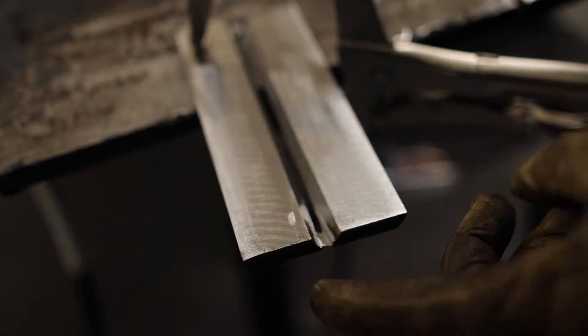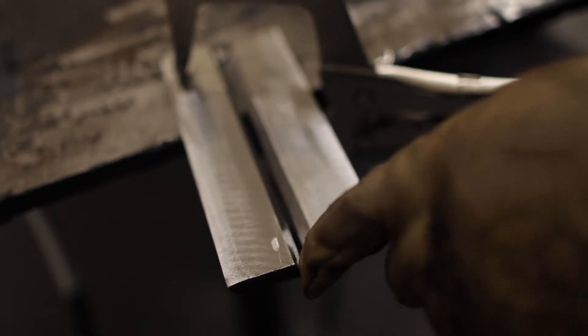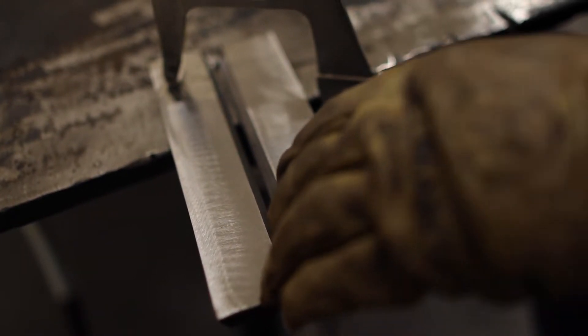So when I fire up on that root right here, that tack will essentially just blow away and I'll have one solid root. That's the proper way to fit up and prep for a 3G MIG root and flux core filling cap.